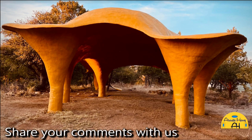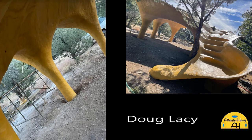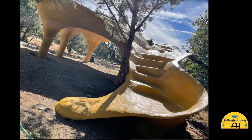I was thinking personally of simple aircrete walls as another method for building out your walls. Yeah, I love the neat cement or the cellular concrete, which is just the aircrete, the foam. Back when I was doing foam concrete back in the 90s and 2000s, there was another person that had this aircrete material. They trained us not to say aircrete back then, but I think they've gone away. It was like this super light insulation that was like cigarette ash when you touched it, but it insulated your walls. I really love it for having that flowable fill that you can just pump right into the walls.